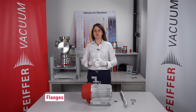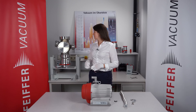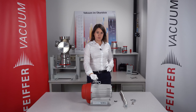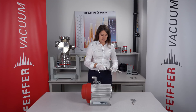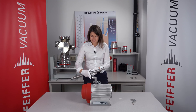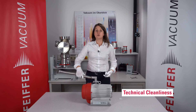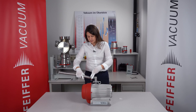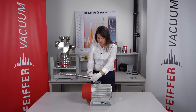Today I talked about chambers, materials, and components. There are different types of flanges to connect the components and the chamber. Here for example we have a CF flange with a metal seal. In the backing pressure regime you can also use elastomer seals like the ISO-KF materials. In any case, be sure that your components and materials are dry and clean — that's why you should always wear grease-free gloves to prevent new contamination of the system.